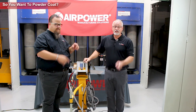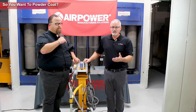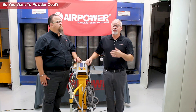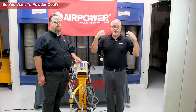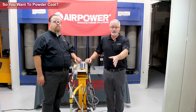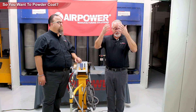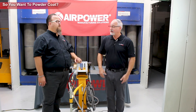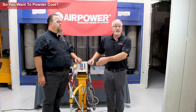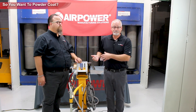Speaking of regulations and OSHA — you have to have some PPE, personal protective equipment. All that's required with powder is a simple dust respirator. However, other people want other means to keep more powder off themselves. If I'm standing behind the part and powder is coming all over me, there are other devices we can help you choose. If you're washing the part and get blowback on you, you need eye protection and face protection. You may even need to dress up in a full suit. If you're blasting, protect yourself with the appropriate blasting equipment.